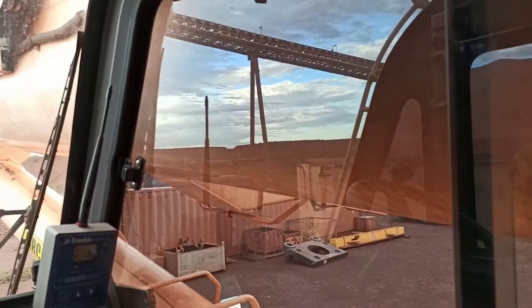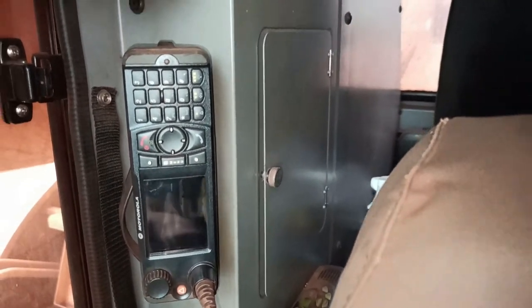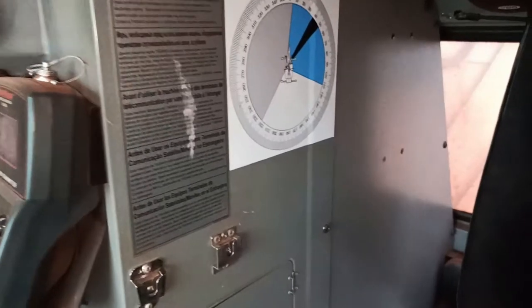So how we fix this is, one, make sure your boom's always greased so it doesn't drag that bottom section out. But two, how we put it back into place is this, all right? And I'll show you. Just behind your seat, there's a box here. That box there. So what we do, bruv, is we grab this box, we unwind it.